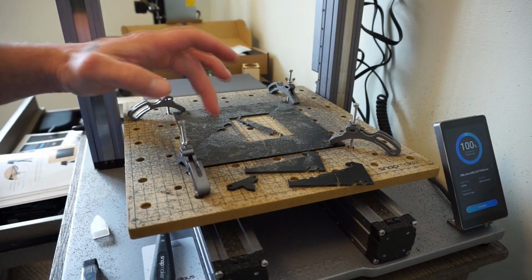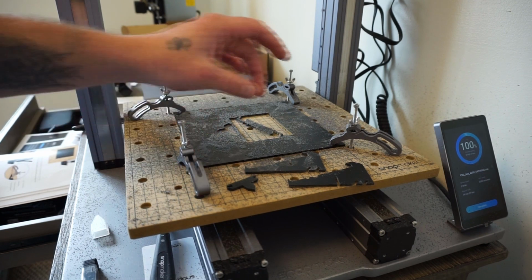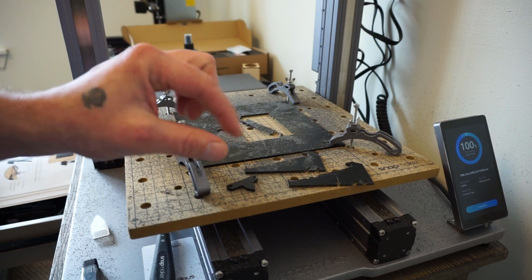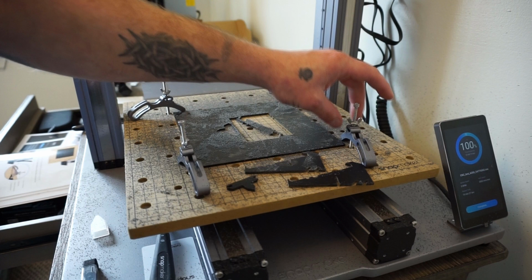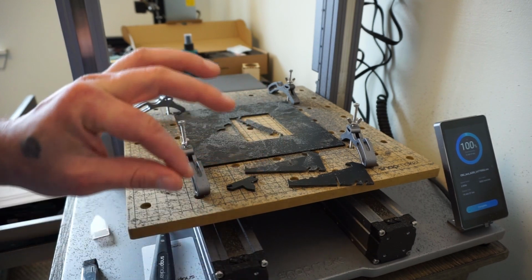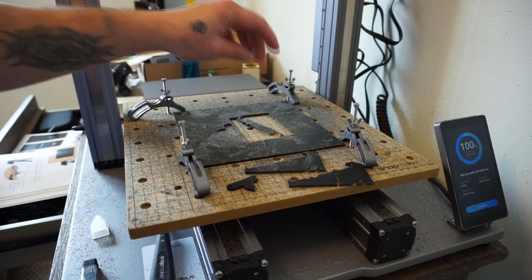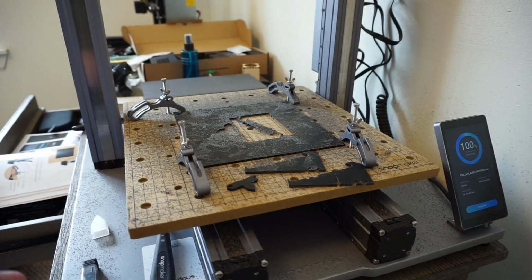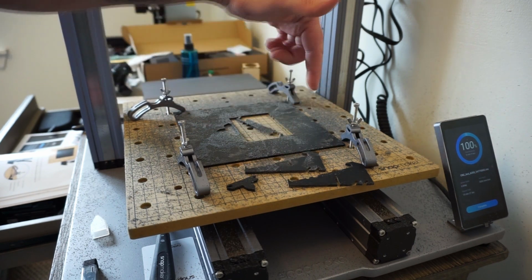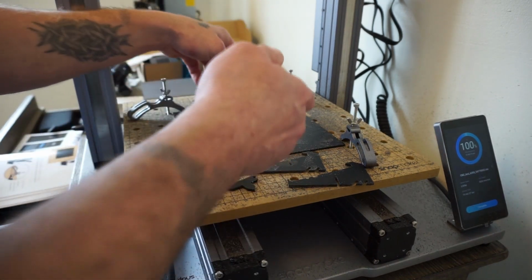Something I'm going to look into getting for the corners, at least when I do this in the future, is maybe a couple little brackets, or not brackets, but spacers. You get some thin material, maybe plastic coat it, rubber coat it, or whatever, to alleviate any vibration. Make sure they are perfectly symmetrical and parallel, also even the whole way through. I can't think of the exact term I'm thinking of right now. Perpendicular is more along the lines of it. And then bring the work piece up off the work surface. That way you can achieve full penetration through it without actually damaging your work surface here.